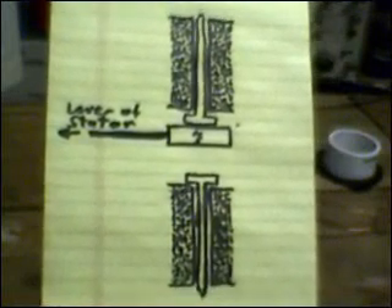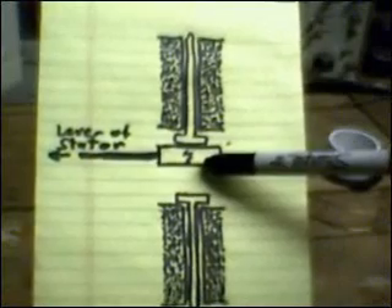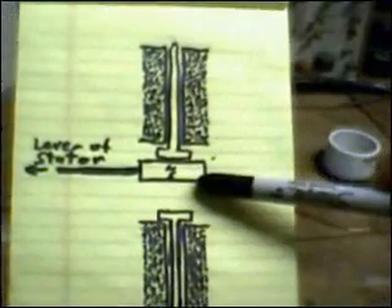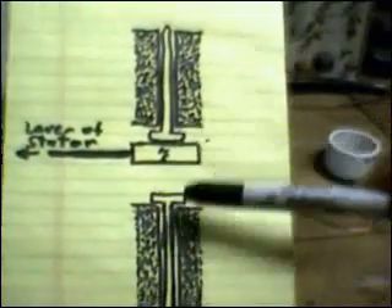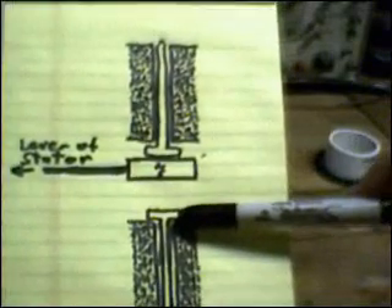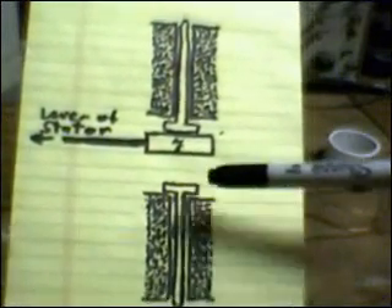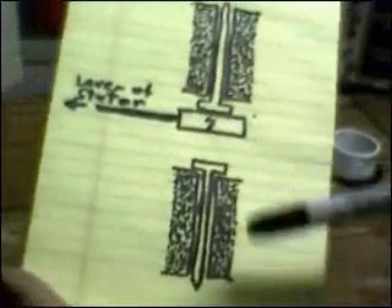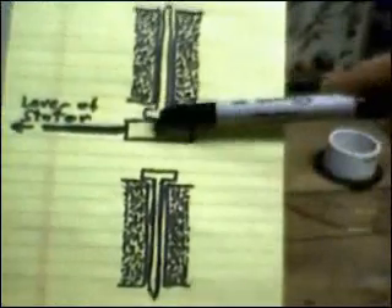The alternative is two electromagnets, top and bottom, with a magnet sitting at the back end of the lever for the stator mechanism — top is north, bottom is south, just as an example. With no electrical current applied to either coil, the magnet will stick to whichever nail is closest and come to rest there. All I need to do is send an electrical impulse at the right time to the appropriate coil with a similar-facing pole to push the magnet away and toward the other pole, where it will hold itself in place until the next pulse.